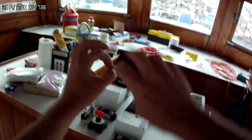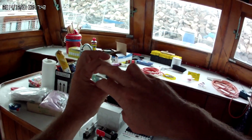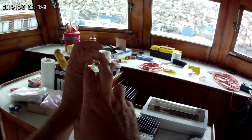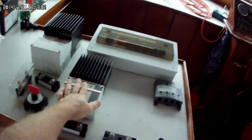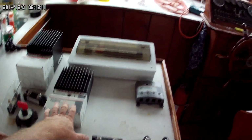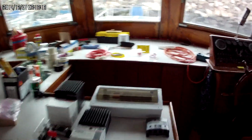What it is, you've got the bung that screws in. Well, it's like a three-phase water heating element. You've got one element that's 600 watts, another element that's 600 watts, and a third element that's 600 watts. So it's 6, 12, 18, 1,800 watts, and I just have them in parallel, and it works, and you screw it right in. Morningstar recommends that this should have an 1,800 watt load that I can control, no less and no more. That's what it's rated for, and to maintain its operation, they suggest to do that, and so that's what I do. So once the solar batteries are charged, let's start making hot water.